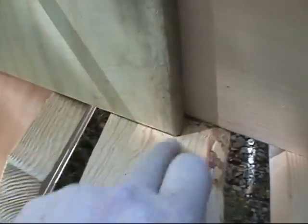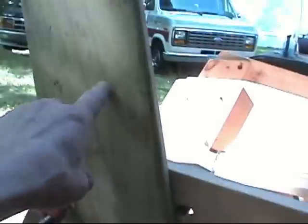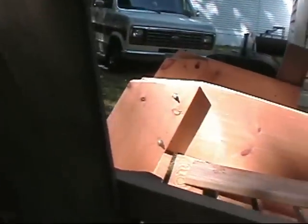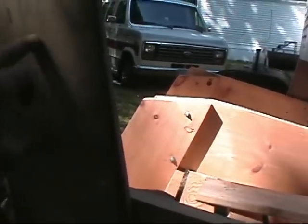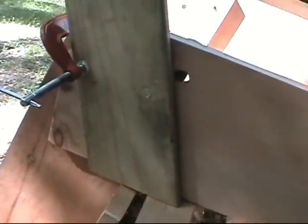Now I've got the angle. We're only interested in this plane right here. This here is the back — that's not right up there tight, but if you feel this here, this is flush right here, and this is the bottom where the seat sits. So now the only thing I've got to do is to get the height from here, transfer it over to here, and we can do that with a block of wood of the right height. And that's it — then we'll do the same on the other side, so we'll be back on this thing when the legs are finished.